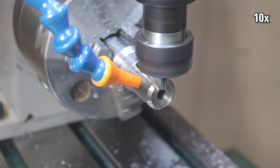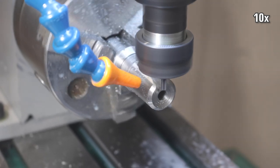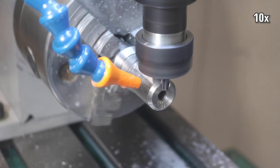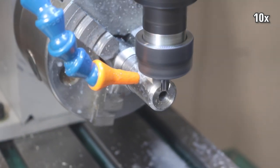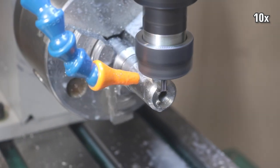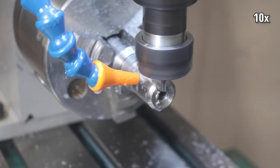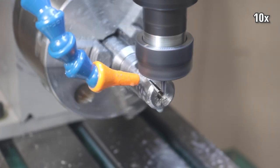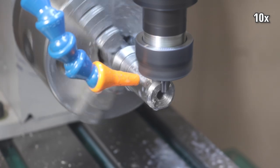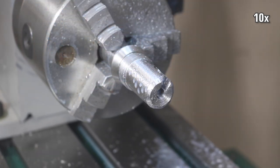Last year I built a fourth axis for my milling machine, and right after I completed it, well, the free version of my CAM software decided to switch simultaneous four-axis toolpaths over to the paid version. I was able to get it to do 2D contours as a simultaneous operation, though, and that's what I'm showing here on this steam engine nozzle. I'm essentially having to ramp down on the geometry at full width of cut, and in order to not break tools in this stainless steel, I had to go pretty slow and take it quite lightly.